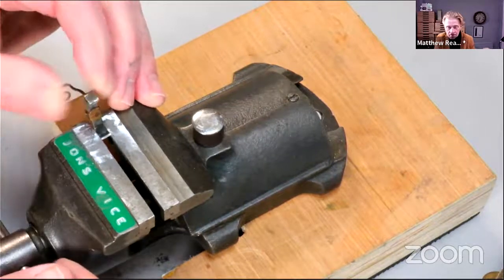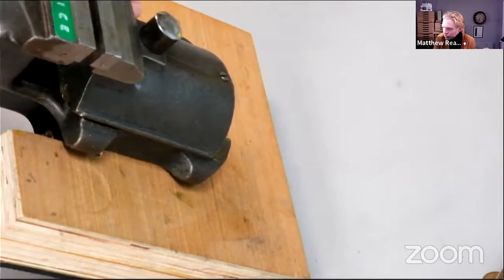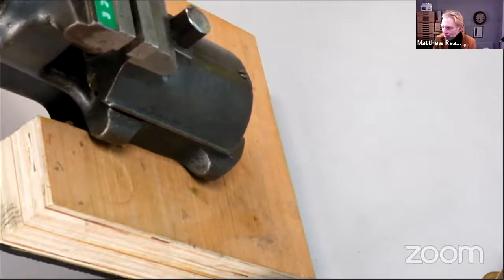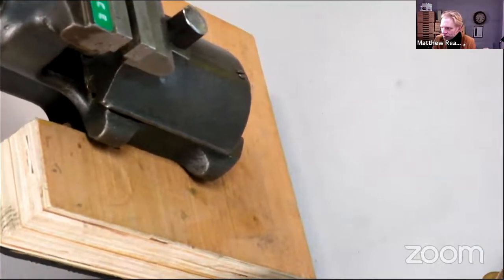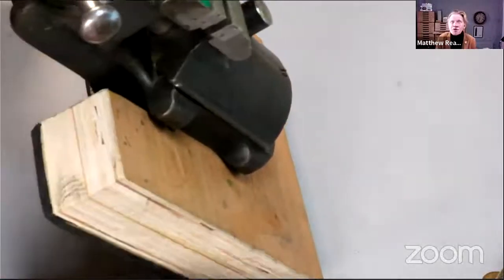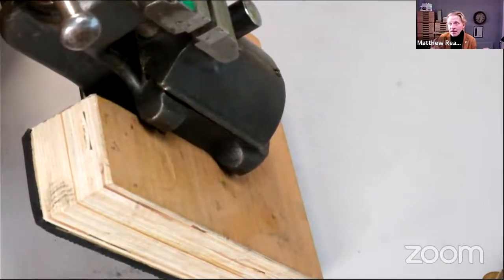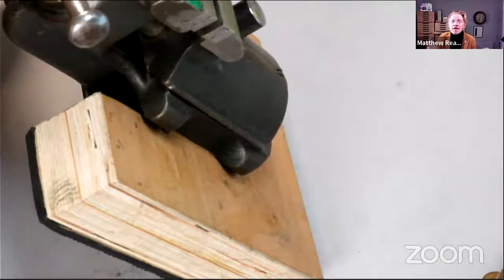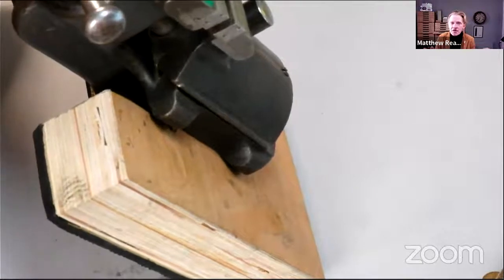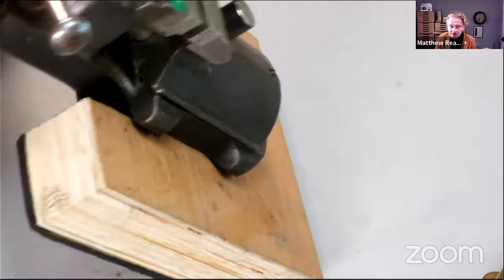Is the answer to Derek's question that it would be hard to know how much to bend before you did the filing? Yeah, you couldn't, because you're talking about such tiny amounts, a tenth of a millimetre or something. So you wouldn't know. If you're making them new, though, what you would do is bend them to shape so they were right for, like, N and a half teeth, and then you would just file back, file back, file back, file back, like you do with the anchor recoil scheme, until they work. But we're not in that situation.